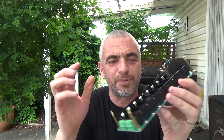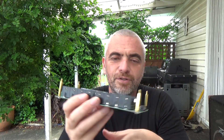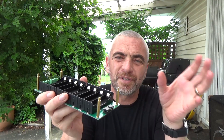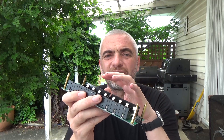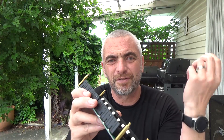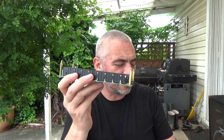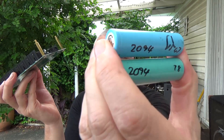Back to the business end of this — what I'm going to do is chuck these batteries into these frames. What I need to be careful of of course is to try and get each parallel set balanced. Thanks to the advice of one of my viewers, I'm going to use the Repacker website where you throw in a CSV file with all of your battery capacities. You tell it how many cells in series you've got and how many in parallel, and it spits out a list of how best to arrange them. I've done that manually in the past and it works fine, but this is really cool.